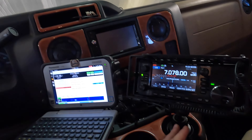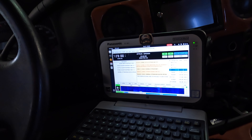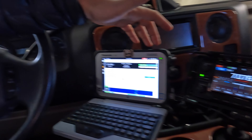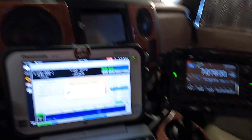We're still running the IC705 on 5 watts. My buddy Mike is right now in Henderson, Nevada, and I'm in California in grid Delta Mike 04 Hotel Hotel — he said good morning. For those of you who think you need a whole lot more: right now with JS8 in slow mode, with a vertical that takes no space whatsoever, hood-mounted with just these two cup holder mounts — don't run them while in motion, the mount is fine in motion when just running the FZM1, but definitely drop the keyboard — it's working great. I've got Navit dialed in and this trip has given me a ton of notes on how to make everything more field expedient, now shifting from man-portable to more vehicle expedient. That message went through from Mike — excellent.